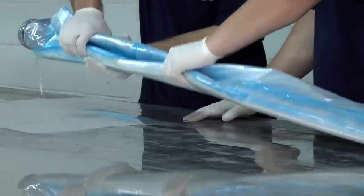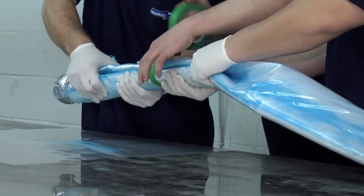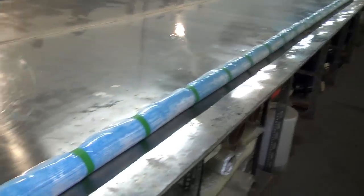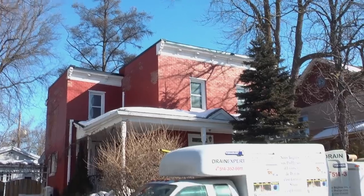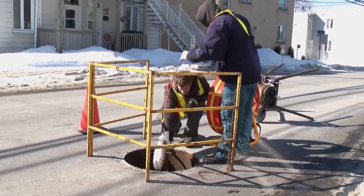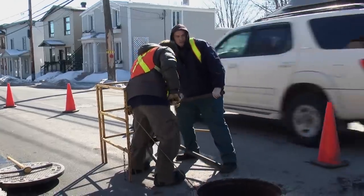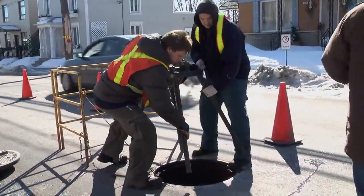Once that is wrapped, we're going to U-fold it to make it smaller. You fold it and U-tape it about every foot, and then it's reeled on a big reel that is supplied with the equipment and taken to the job site. Once we get on site, since it's a pulled-in-place process, we're going to need to string a line from the upstream access to a downstream access.